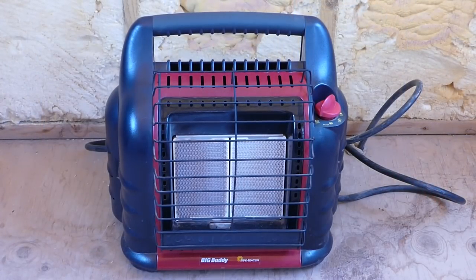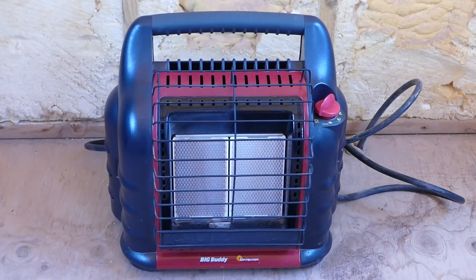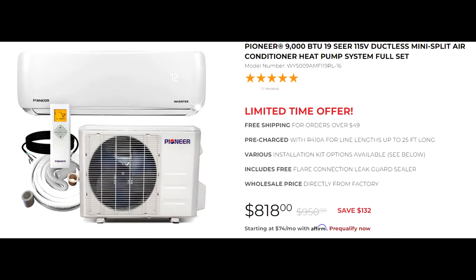So even though, folks, I normally heat this building, as I mentioned in the last video, with the Big Buddy heater, it's still very useful. It'll heat this building up in no time flat. The little heater on the 750 watt setting takes a lot longer. And I had another reason for using this little heater. I want to eventually incorporate a mini split, and the low wattage on those is around 900 to a little over 1,000 watts for the really power-wise type models.